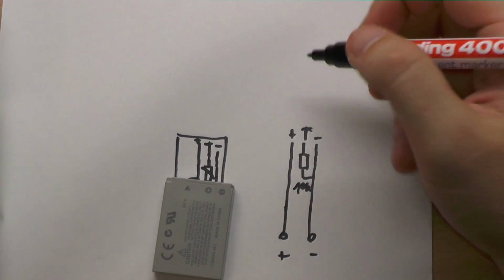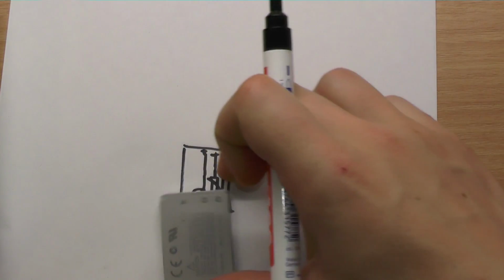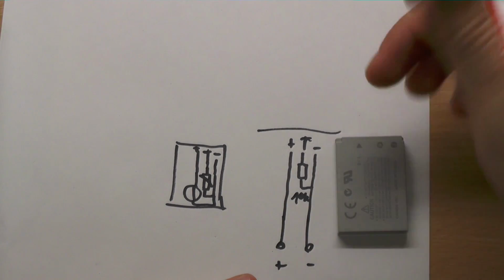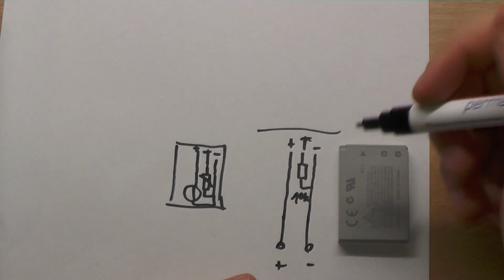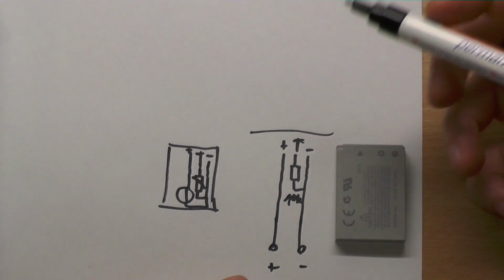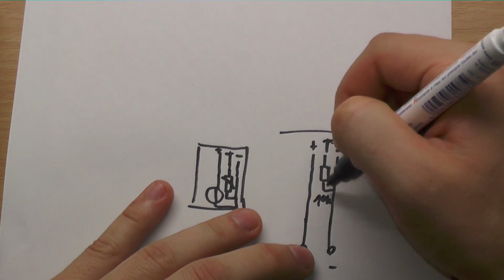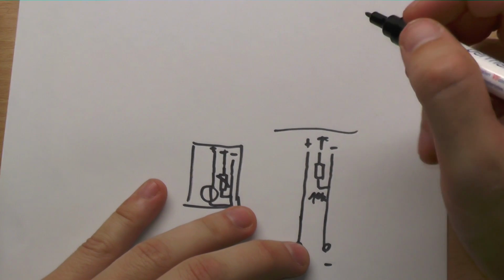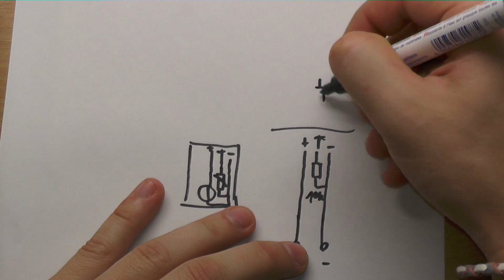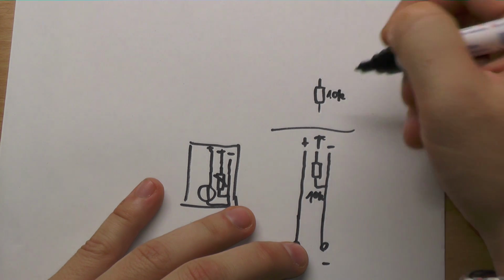this battery. And we could also measure this temperature if we want to use this battery. So we want this other side here, and how we can control this circuit and measure this resistance here. So there is a simple way. You can say, okay, I can't measure the resistance directly, but I can measure it indirectly. So I will just put another resistor here, like maybe also 10K, 10K or even higher. The higher the better.